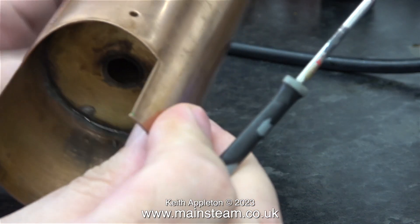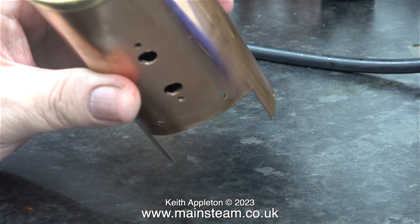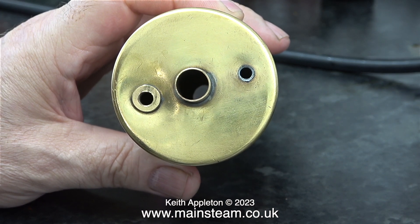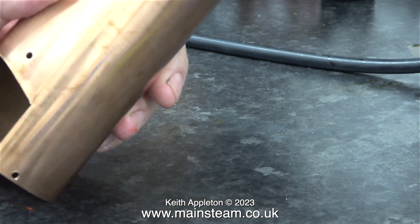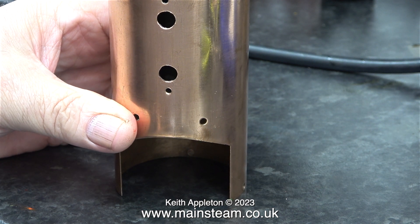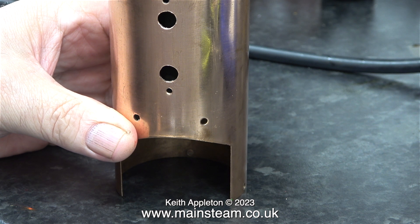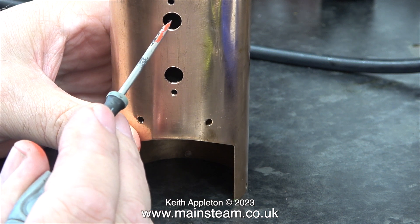The intermission's over and I'm looking at the component parts of the boiler. It has a brass cap and a brass inner tube plate and the rest of it is copper. I always intended to give this boiler a hydraulic test towards the end of the series before steam testing it. I have no confidence whatsoever in the soft-soldered joints, so I could re-soft-solder the joints, but maybe I should make a new boiler.